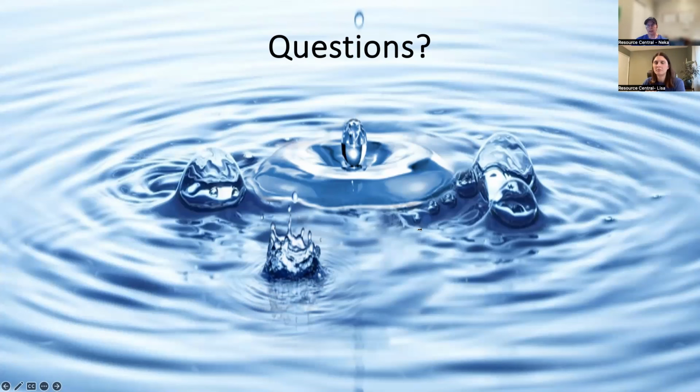And what makes them a zone is they are connected underground by the PVC piping that Lisa showed on one of her earlier slides. And then that piping goes back to a valve. So if you put more piping or more heads connected to that same valve, you're not controlling another zone. The valve makes the zone. So one valve, when that valve opens, whatever heads pop up, whatever is connected underground to that valve, that is a zone. Yeah. So one valve equals one zone.